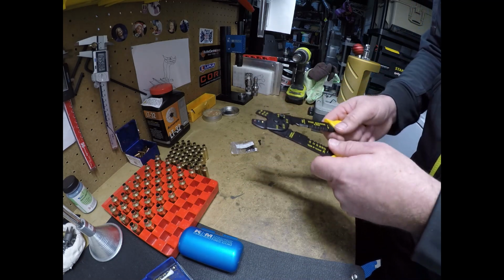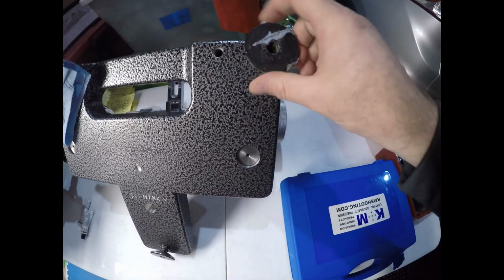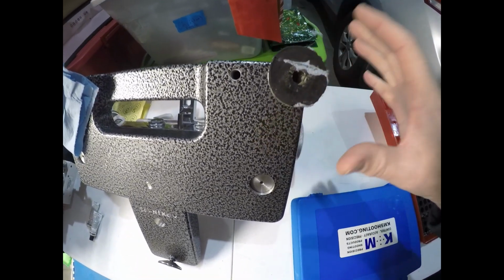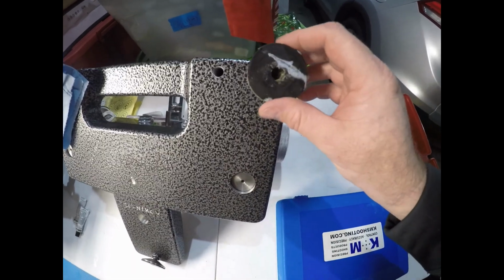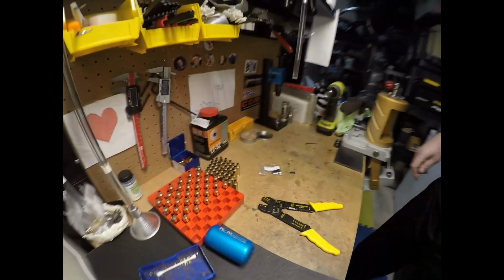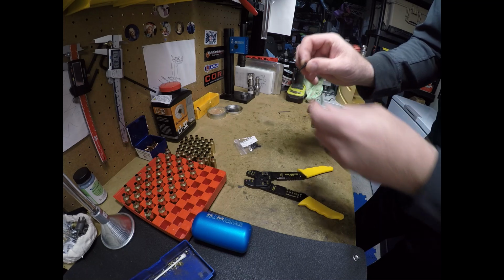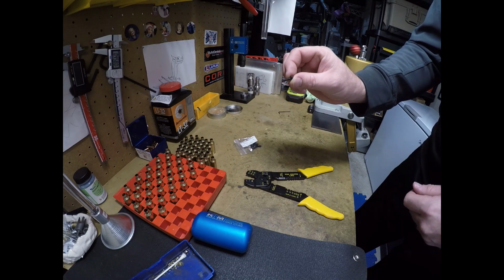That actually is what happened just this weekend. My Seb Max Rest had a bolt in it that bent. It was the bolt inside the foot here that holds this little foot in place. This foot really holds the rest down onto the bench and keeps it very steady. That bolt inside there, you may not be able to see it, was bent. So I had to pull it out, and I found I have some bolts that would fit, but when I went to screw it in, it stopped about halfway down. So it told me there's a stop in there, and this screw is way too long. I need to cut it in half, basically.